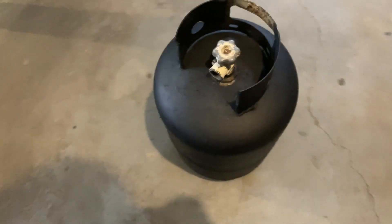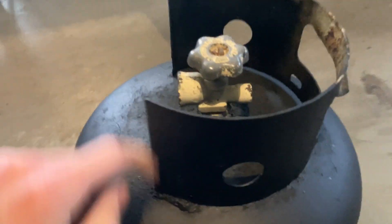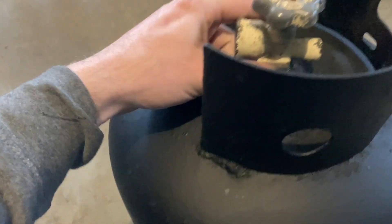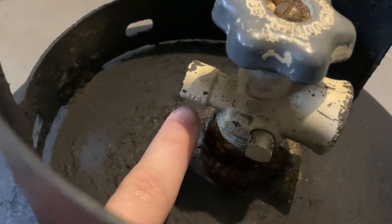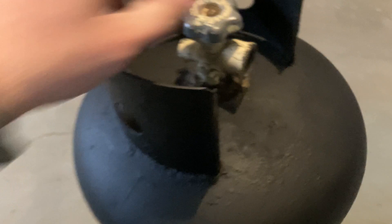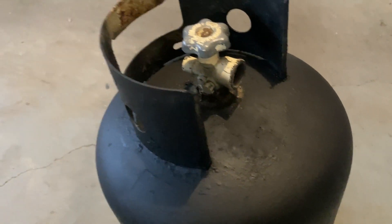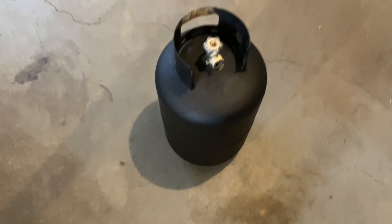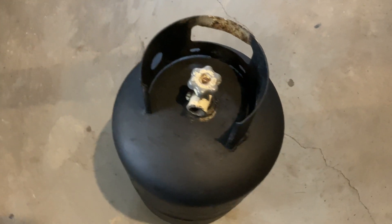If you want to make an air tank out of these, they're perfect for air tanks. Down in here you can see it says 375 — that's the blow-off valve pressure on the back. The tank can hold more than that, which makes them perfect. I'm going to run about 120 pounds in it just because it makes me feel better, since I still don't fully trust it.